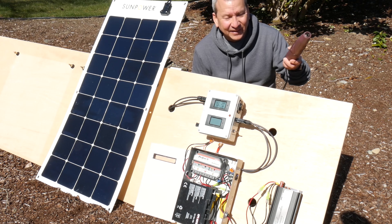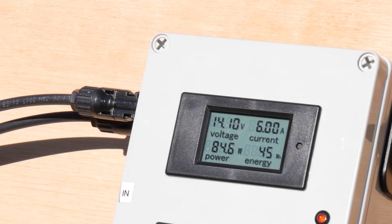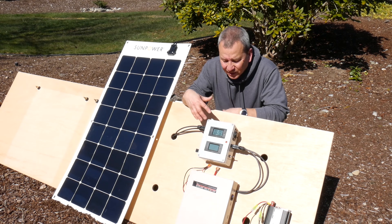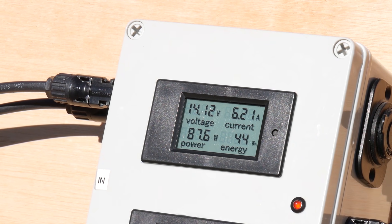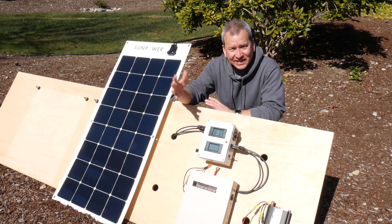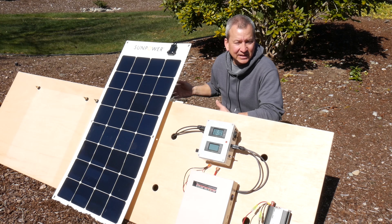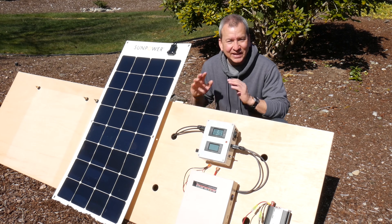So let me power up this heat gun and we'll see what kind of power we can get out of the SunPower solar panel. The current output of this panel with the heat gun load was pulling just about 6 amps, or maybe a little bit more at times — I've actually had it up to 6.2 when I tested it earlier. But there's a slight haze that's come over the sun while I was testing. Six amps is pretty good, because the operating current rating on this panel is 6 amps, so it met its rating.